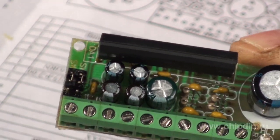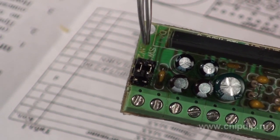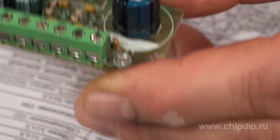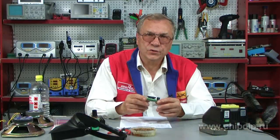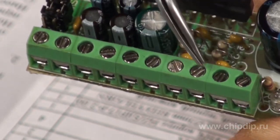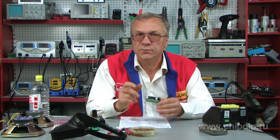SW2 switch, located on the printed circuit board, ensures switching into a standby or sleep mode — that means it turns off the microchip's operation mode. Capacitor C9 is the main stabilizing link of the circuit's power supply. Acoustics is connected to outputs X6, X7, X8, and X9. None of the speaker's outputs are connected with the mass, but only by numbering designated on the circuit and the board itself — output 1 plus/minus and output 2 plus/minus. The amplifier has a bridge circuit design.